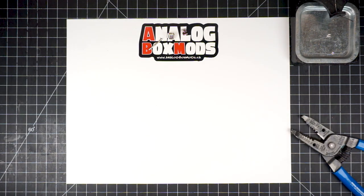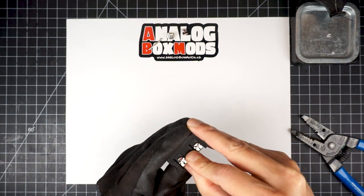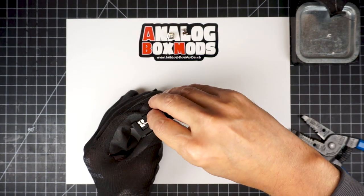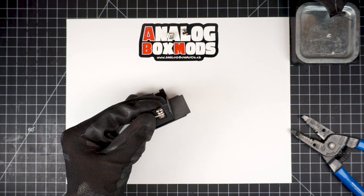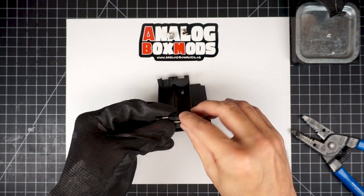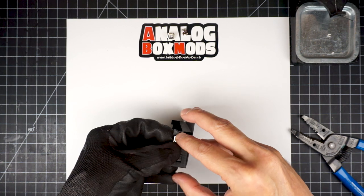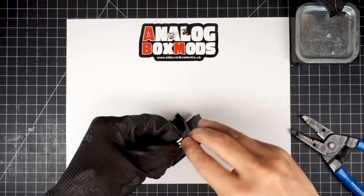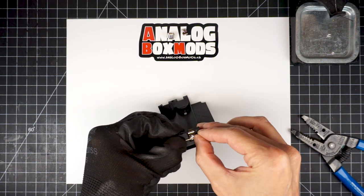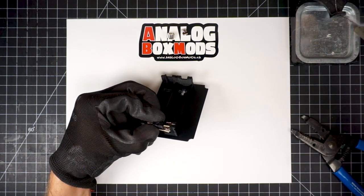Now we're working with a short run of wire with the insulation removed, so I've got my Michael Jackson glove on there. It's vinyl coated, so it's actually pretty heat resistant, so I can hold components like that and get the soldering iron really close. I've said in a lot of videos not to solder onto 3D printed sleds with the contacts on them. The thermal plastic, in this case the ABS that's used for 3D printing, will melt at a much lower temperature than the iron's at.